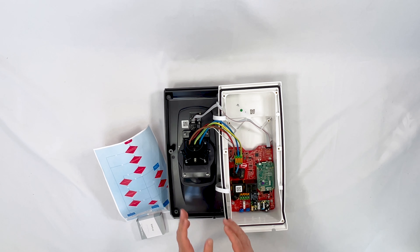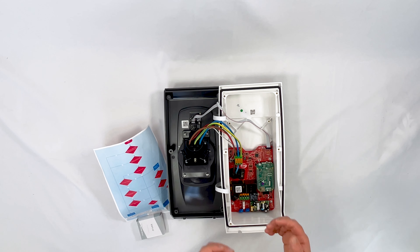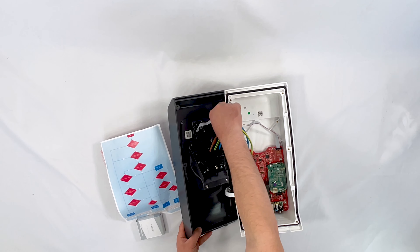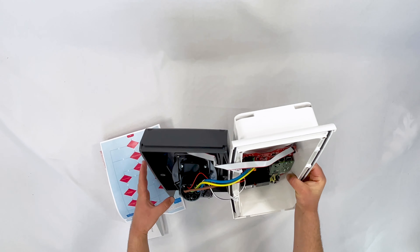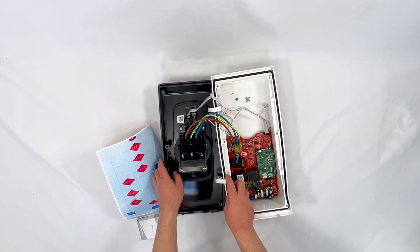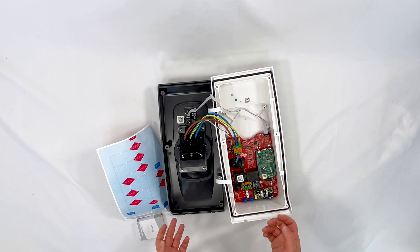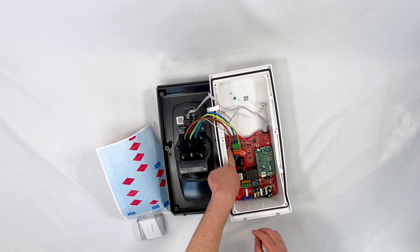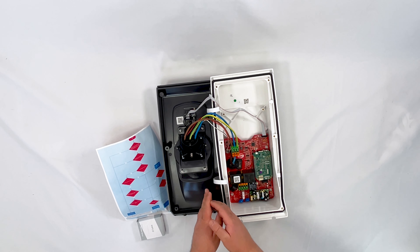One concern with a similar design on another unit was that the weight of cables could cause strain when installed. These two ribbon cables here are designed to deal with that issue - the ribbon cables, basically pieces of plastic, take the strain off the main cables. But if an engineer wanted it a little bit easier to install, they could unclick these WAGO terminals to disconnect the comms, disconnect this ribbon cable, undo these screws, and the two units are completely separated.